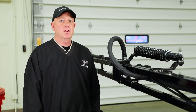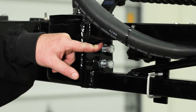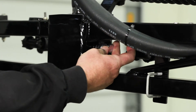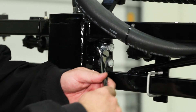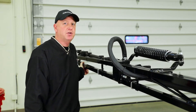The next adjustment is for the outer boom breakaway. We'll adjust this so that it's straight with the outer boom. The adjustment is made with this set bolt and lock nut. We'll loosen the nut and adjust the bolt to make sure that the breakaway is straight with the outer boom. Once that's straight, we'll tighten the nut and make sure that the boom breakaway comes back straight.